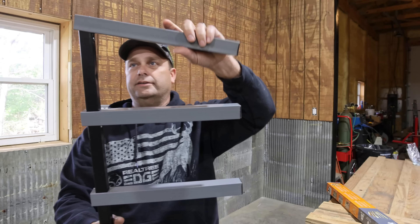So before we covered this up, we did put some vertical supports in this wall to mount the lumber rack on. What we're going to be using today is a Bora wall rack, and this is supposed to hold 660 pounds. You're supposed to be able to mount these — it comes with basically two racks that you can mount four to six feet apart. But to me, that is too far apart. I don't want the lumber to sag in the middle, so I ended up buying two sets of these. There's a total of four we're going to put on the wall, and they're going to be every two feet apart.